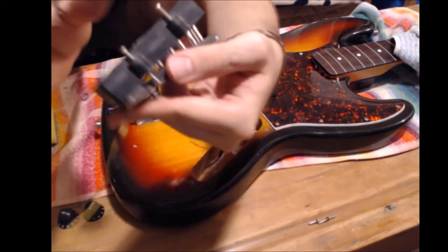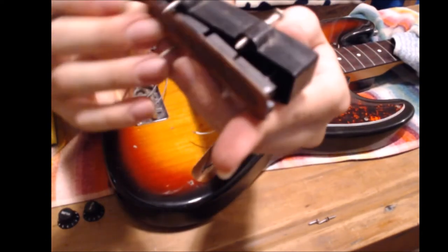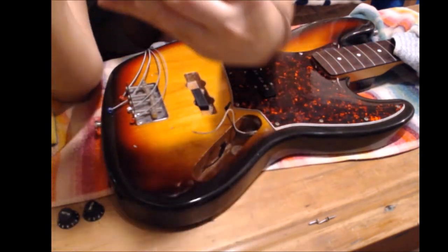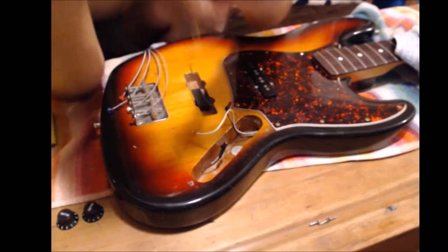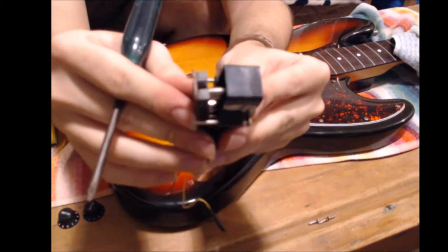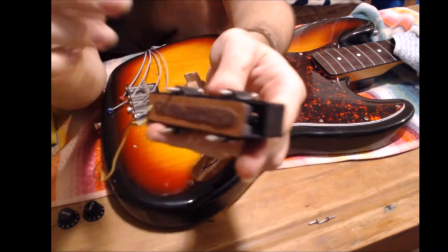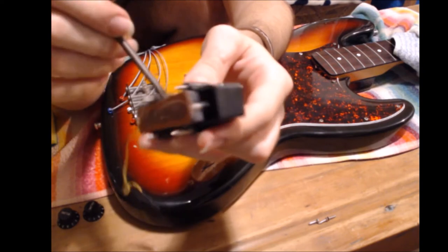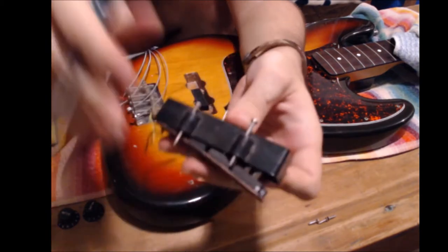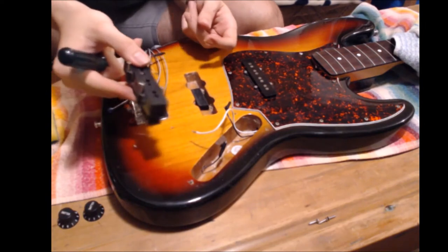So, I don't really want to take this apart anymore because I think I'll break it, but if you look in there, you can see there are four magnets on either side of these poles. The windings haven't come out, so they're still inside here, but you can see them just in there, there's a little pocket that has the windings. But these magnets are just little bar magnets, probably ceramics, on either side of these pole pieces. So I'll put that back together in a second, but I'll take out the other one and I'll worry about these later. I don't really have anything to do with these at the moment.